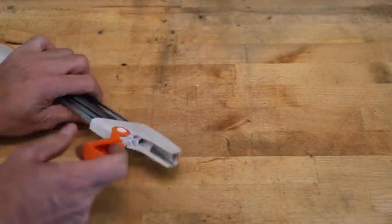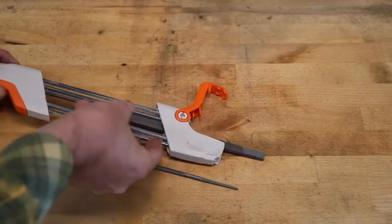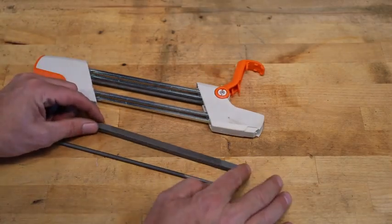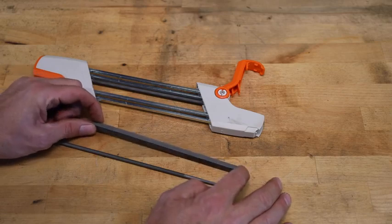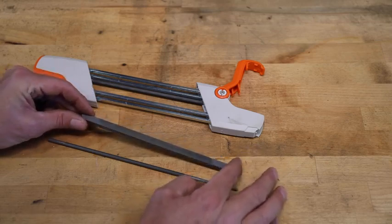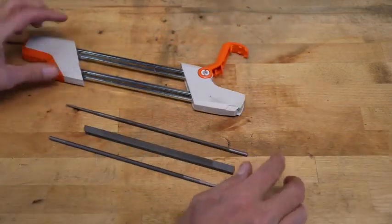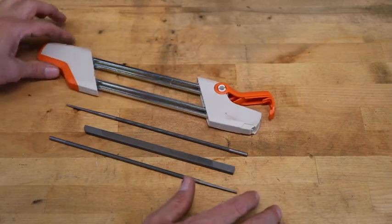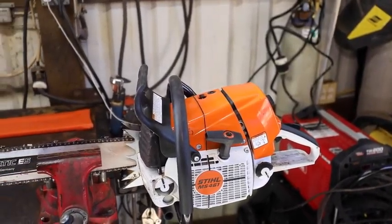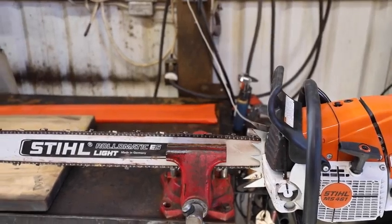So I continued to get more and more requests for it. I went on Amazon and I ordered one, and here it is — it does look kind of ridiculous. So let's break it down. What we have here, I think they're calling it a two-in-one. What it claims to be able to do is file not only the teeth but the depth gauges — some people misappropriate the name 'rakers,' but they're depth gauges. The file in the middle, which is obviously proprietary — I've never seen a file like that before — is a flat file intended for the rakers. And here we have the third file for the other side, so if we flip the tool we can file both sides. The saw I'll be filing today is my new 461 with the 32-inch bar, a factory steel chain that I've run a fair amount and it is time to be sharpened.